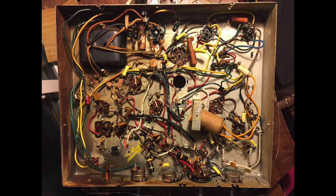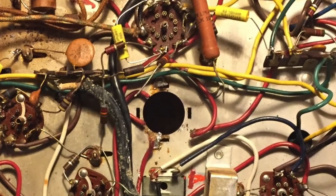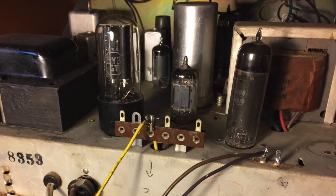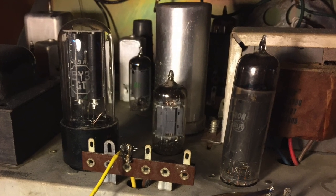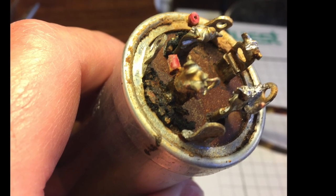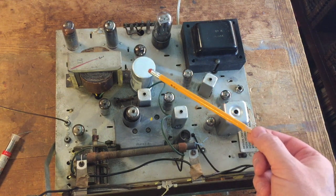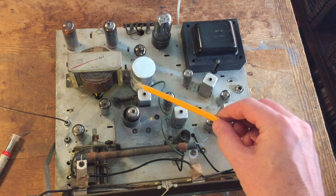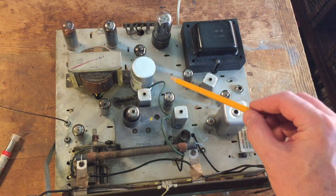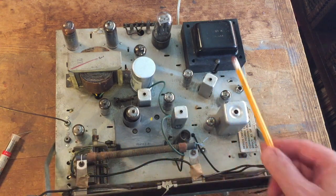You can see the yellow ones there — that's the after picture. Before, after, before, after. But notice in the center there's something missing. What's that giant hole right there? That wasn't there before. Turning it over, you see that bright shiny cylinder? That is a four-chamber capacitor used for filtering power, and that is the source of our hum. That thing doesn't work anymore. You see that junk leaking out the bottom of it? That's not good. Fortunately, all these capacitors are still readily available. I ordered this one from Amplified Parts — it was almost exactly like the one that was there before. One of the four chambers was different, and I had to augment it with a second capacitor inside, but it worked fine. And now there is no hum coming through this module anymore, which is wonderful.